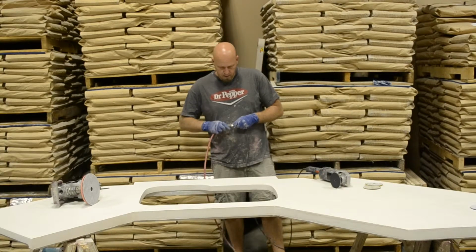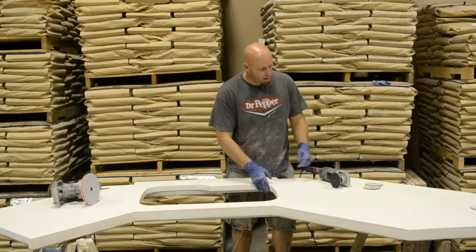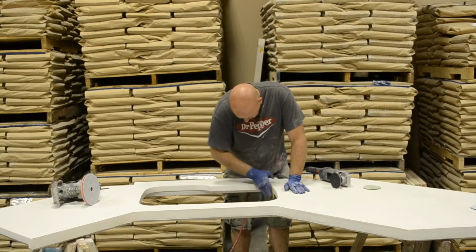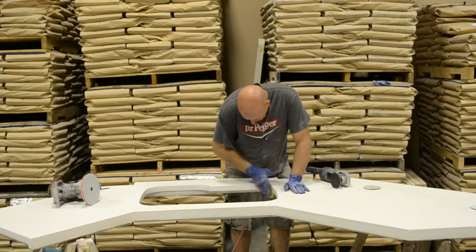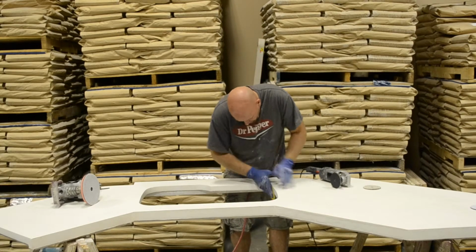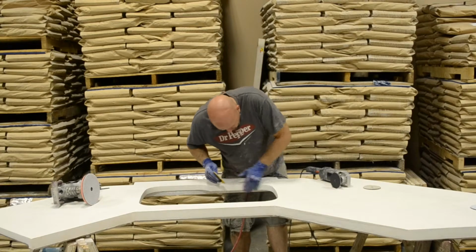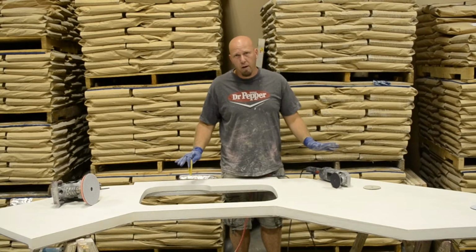We've got, now remember we took that grinding stone and brought these out right here. I'm going to take my 100 grit dry pad here to kind of clean up these edges to take off my grout. No, I'm not going to do any machine tooling. This is all going to be by hand right here. And then I'll step up on my edges. I'll go to my 100 pad and then up to my 400, and I call it good on my edges.